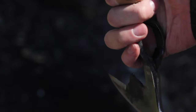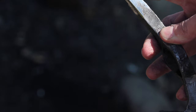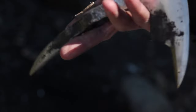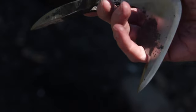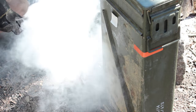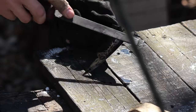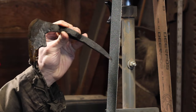We'll just quench it. Even though this is not a high carbon steel spike, I'm still going to quench the end here. I think what I'm going to do is quench the spike first and then quench the blade, and I'm going to use my deer tallow because that seems to work well for doing sort of a black oxide coating. Here's what it's looking like after the temper - everything's looking pretty good. We'll just sharpen it up and put it on the handle.